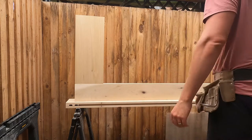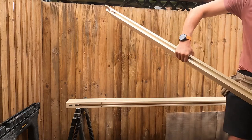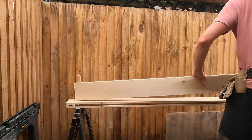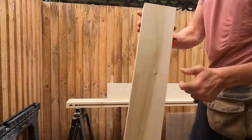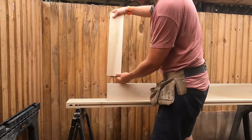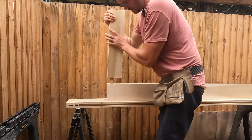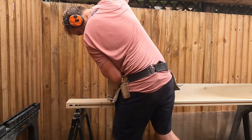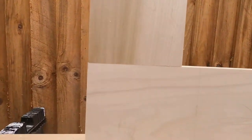I'm going to do the same on the top. Just flip it round so I can show you what it looks like when you push it in there. I'm going to be careful not to damage any of the edges. Got the face mark there, got the domino bit in there, and all we've got to do is line it up and push it home. Now these aren't really tight. There you go — and as you can see, that is a beautiful fit.